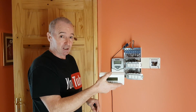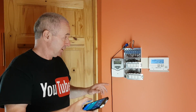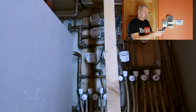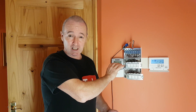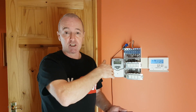I have to put the time clock back on — let's try this out. I've run it out with the multimeter, no shorts, so everything should be okay. I've got everything on; I'm going to switch everything off so the actuators should have gone off inside, then switch everything on again and they should come on. Excellent. I wired this about 15 years ago and I'd forgotten what wires went where — they're all brown or blue here, except the earth ones which are green.